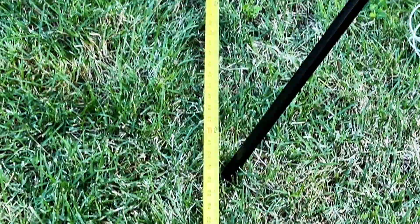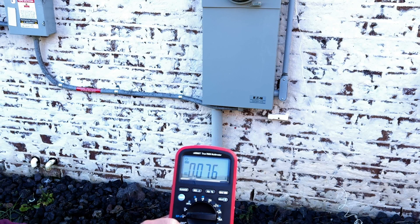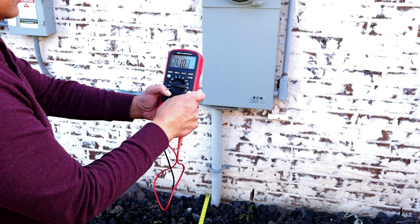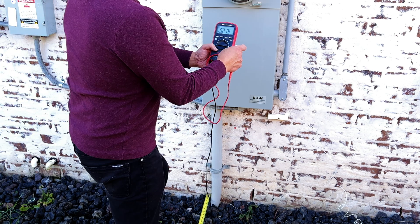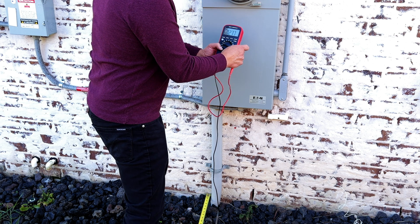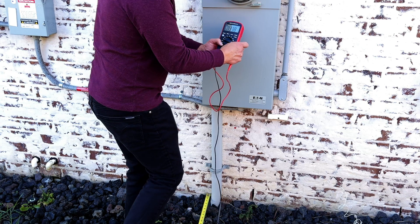Let's move back seven feet from the power meter. At seven feet away, the induced body voltage is 77 millivolts AC. As I walk closer to the power meter, the voltage increases to 85, 93, 144, 165, 338 millivolts alternating current. The closer my body gets to extremely low frequency EMFs, the higher the induced alternating currents and voltages will be on my body.